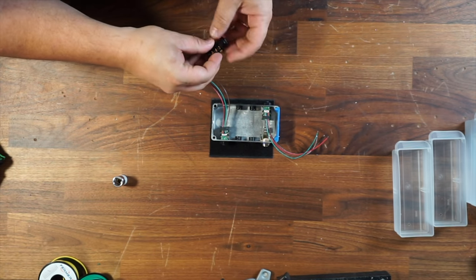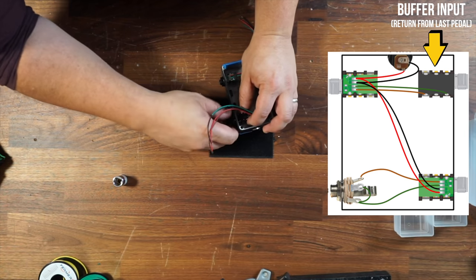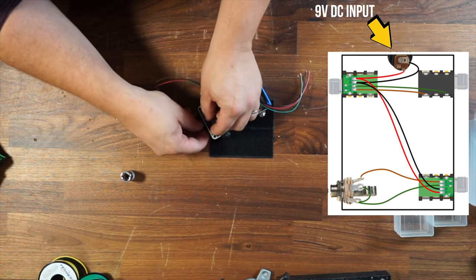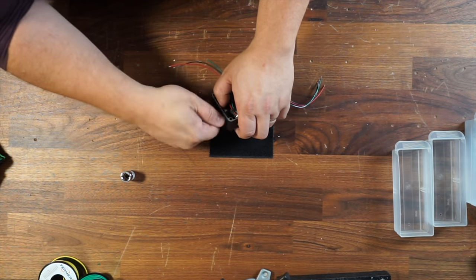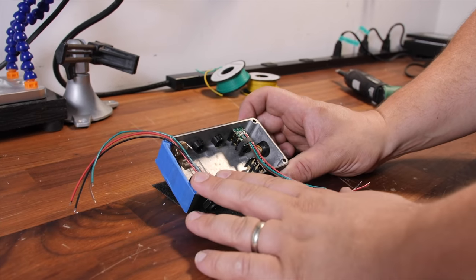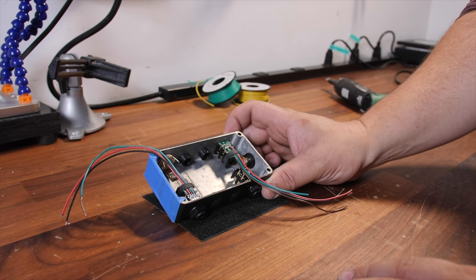And then I have another jack that sits on the side. The jacks that we're going to be using today are from Neutrik, and I'm going to link these in the description. Now I need to put in my 9-volt. Make sure that everything's fitting really nicely — I'm not tightening them down all the way; this is just to make sure I have all the spacing where it needs to be. Then we can make adjustments from there. I'm going to tighten these down completely and wire these leads into their appropriate places. We're going to wire in the power for the DC jack, and then we'll be able to test this thing and see that it works.